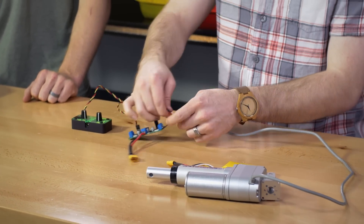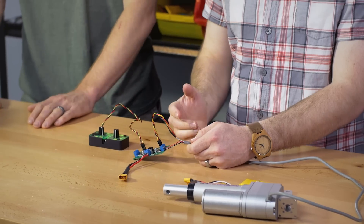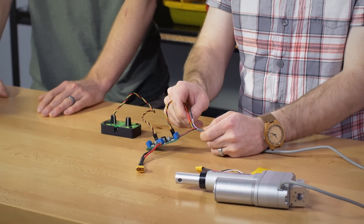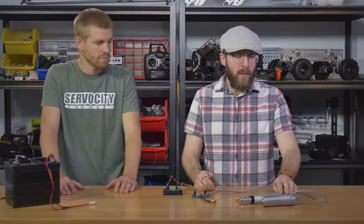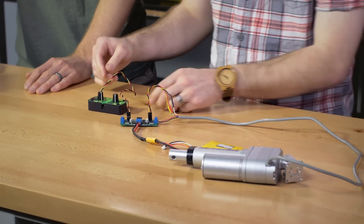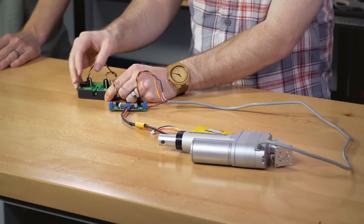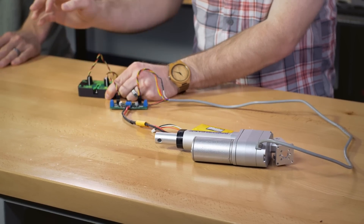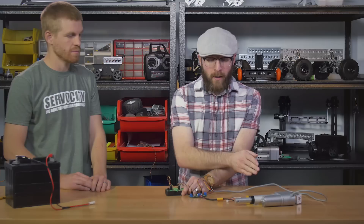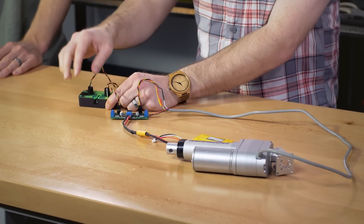The thing to note when you're connecting a linear actuator like this is you want to make sure you know which wire is which — refer to the documentation. In this case, the blue wire is the wiper on the pot, and it literally is just a potentiometer that's built into the case here, being driven by the motor. You saw that it jumped to a particular position based on where the knob was when I powered up the unit. As I turn this knob, it's going to move just until it gets to that position, proportional — comparing the overall stroke to the overall rotation amount on the dial.